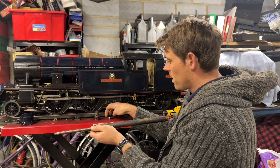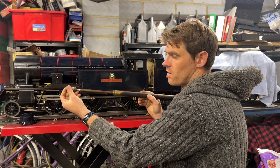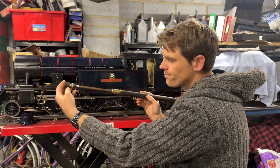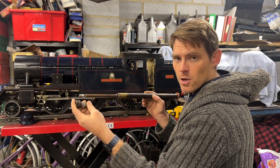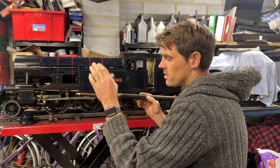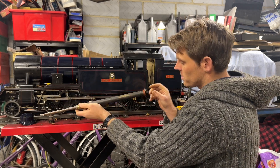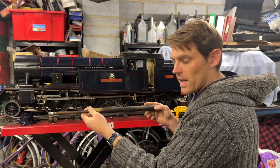This engine has a banjo bolt which is screwed onto the pipe, onto the steam pipe, and into the bush on the front. The steam comes out of this through the banjo bolt into the superheater, so that had to come out. The superheater is still in at the moment — that might come out. And yes, we'll have a look at how this regulator works. Obviously there's a turning handle in the cab — what does the turning handle do?